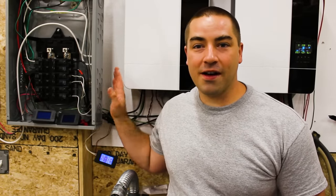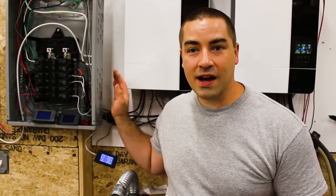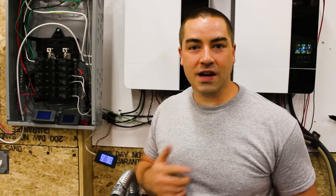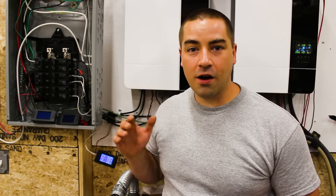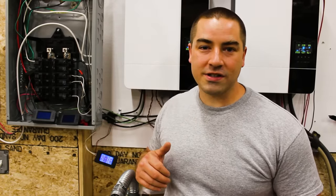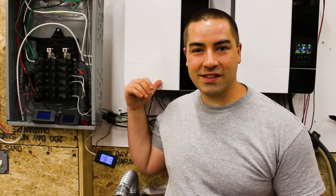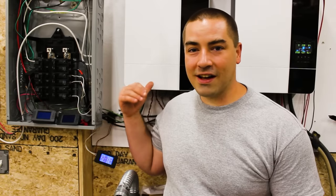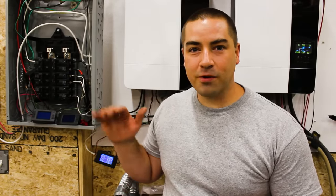It's neat that now I have the air conditioner, or really the heater too for the building, on just this dedicated load center. So now even if the house is on the grid, I can still be operating the climate control for this building off the grid on these inverters. And I don't even need the auto transformer for it. It can run on these inverters directly. And because it's a soft start, I don't have to worry about surge capacity with this. It ramps up real slow.